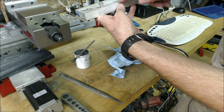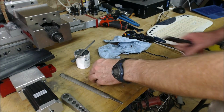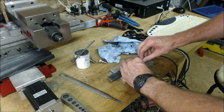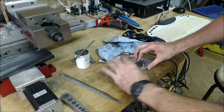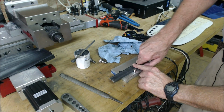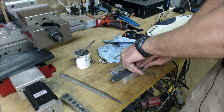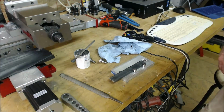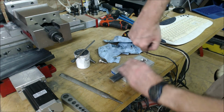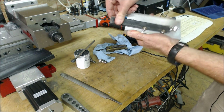And with the amount of shoulder that's on there, I can actually take 1/4 inch steel plates. I'll get rid of those. And slide those to rest up against the shoulders of those. And I can actually tighten these down to hold that in place. That holds it right up against the edge there. And it holds in there really strong.